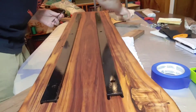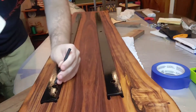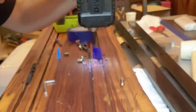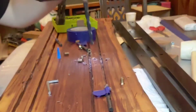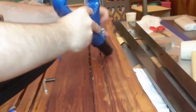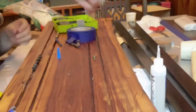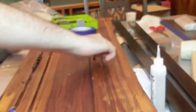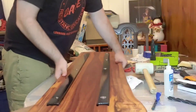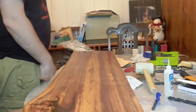I'll put a link in the description for all of the products that I like. Here's the C-channel — all I'm doing is inlaying this, and now that it's inlaid, I'm finding my spacing to get the correct size router bit so that I can put these furniture bolts in. The theory behind these furniture bolts is that I wanted this project to be able to take apart. I didn't want it to be one solid piece in case I needed to move it — because it's going to be pretty long, having to pivot up a corner of stairs and whatnot. I wanted it to be able to be removed.